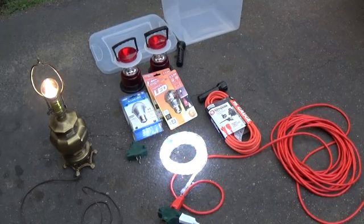At this point, this 410-watt Schumacher power inverter is using approximately 7 to 8 watts for the rope lighting and 2.5 watts for the lamp. You add all that together and you still have plenty of room for more items such as a small television — and I'm not talking about one of the older type televisions, but a very small low-wattage television so that you can actually see what is going on around you if a disaster has occurred.